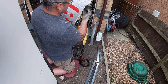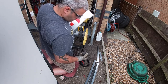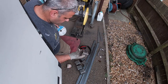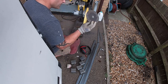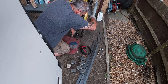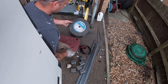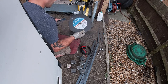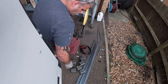So that's one cut. I've got to cut a diagonal down there and a straight down there, and that'll give me the right shape. That's one — another five to go. I've cut all six cubes. You go through quite a few discs with this thicker gauge steel — it all breaks down to carbon material — and wears them out pretty quick. Luckily I've got loads of them; I think a pack of ten is about fifteen to twenty quid. So that's them done.